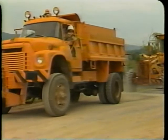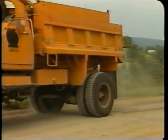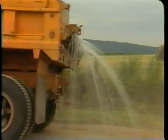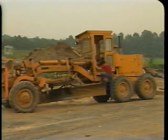If these operations must be done during dry weather, spray just enough water on the road to dampen the surface. However, the best time to perform these operations is immediately after a rain. The damp surface will be softer for blading and will prevent the loss of fine particles. Because smoothing and reshaping are different operations, we will cover each operation separately.